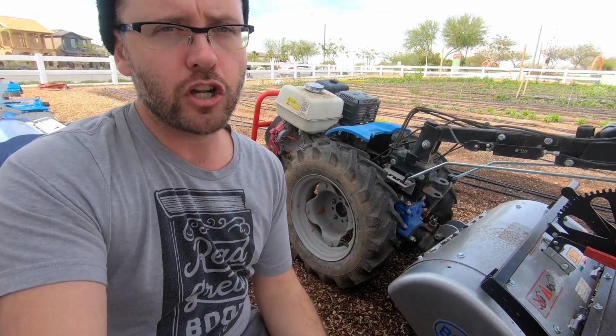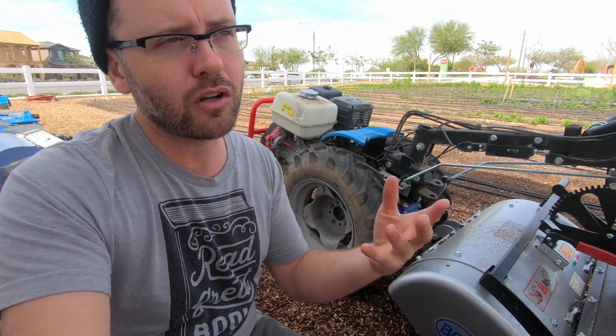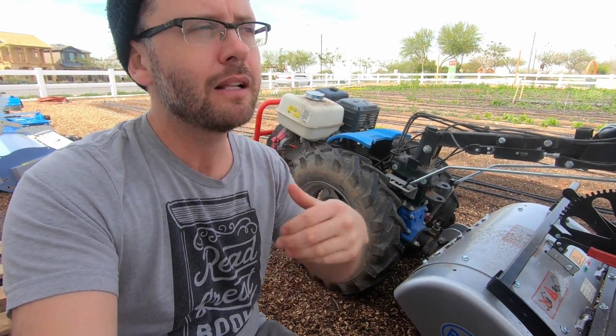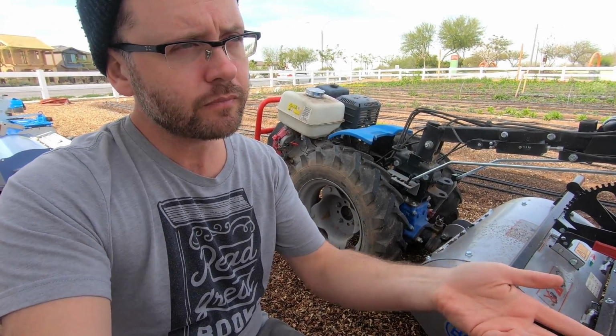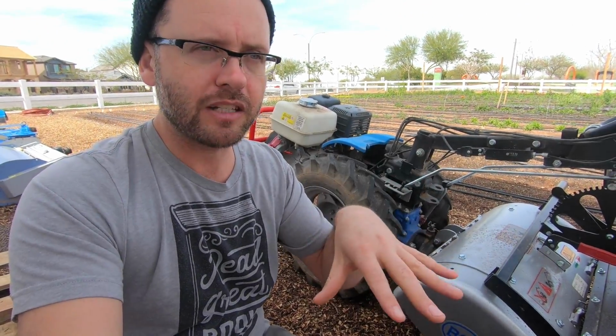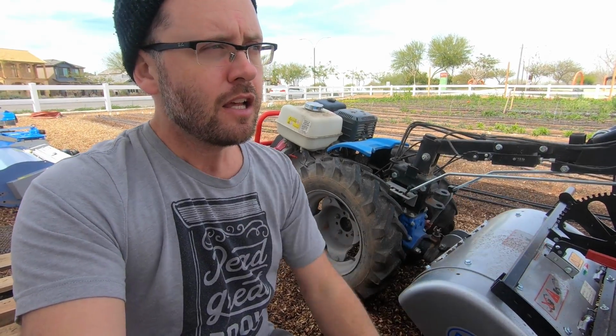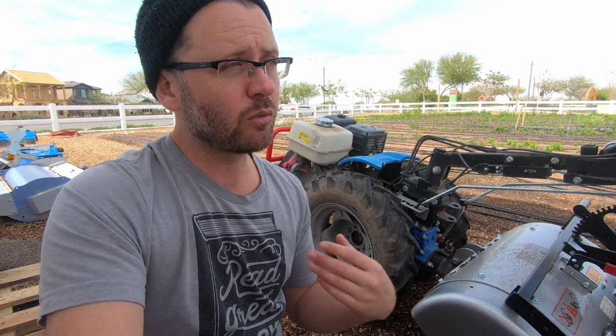So it really depends on your protocol. Just like how I explained the reasons why I'm only using a PDR, it's because my protocol is to remove the previous organic matter from the crop, then I run my PDR. If you're not doing that and you're running, say, a flail mower, and then you're going to immediately use a PDR or a power harrow right after to finish that off, mix that into the soil a little bit so the crop can decompose, and then you might tarp it or something like that for a couple weeks, then you should have a quick coupler, because you're going to have to change that implement on a regular basis, and not having that quick coupler is a hassle. So you really do need to have that if you're going to change your implements on a day-to-day basis.